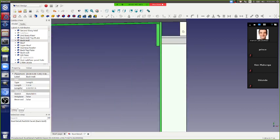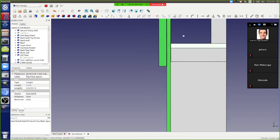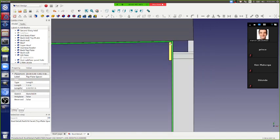And the detail up there, this is what we're talking about, that riser. That's the angle creator. That's a 2x4 and a 1/2 inch plywood. Just put it on top. We should probably pre-cut these strips and then attach the block to it so we don't have to, you want to screw it in from the bottom. So these two pieces here, we want to prepare as a module. That's the riser. Now what's going to happen there is you're going to have this gap, but the interior plywood is going to be all the way up to the ceiling, so it closes it, and then trim so it looks neat. That's the details there.